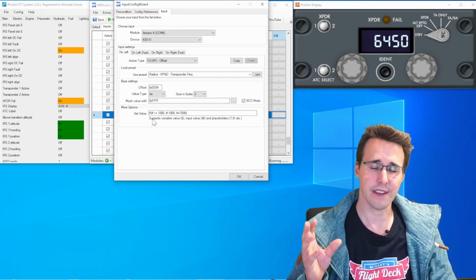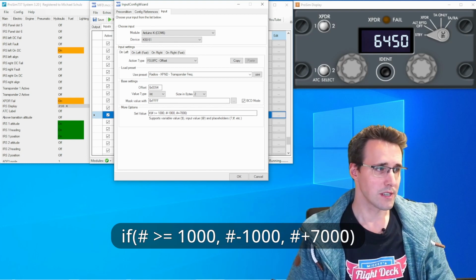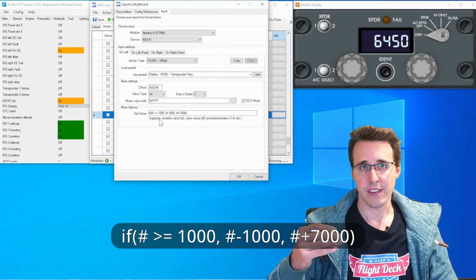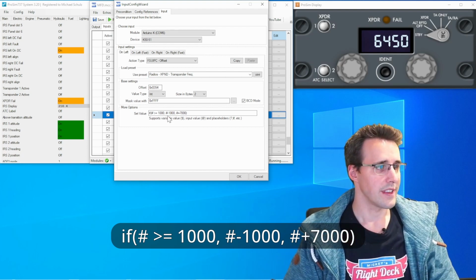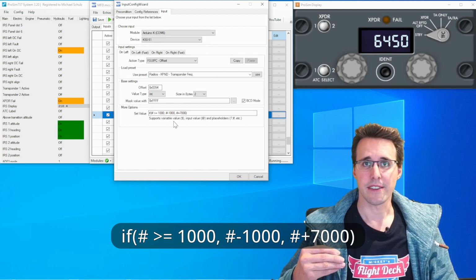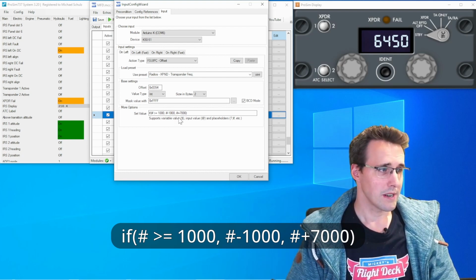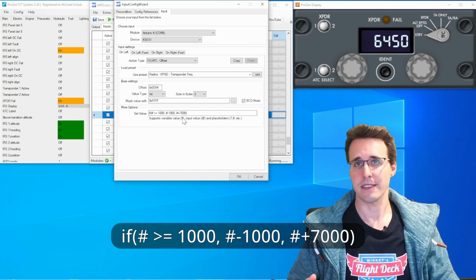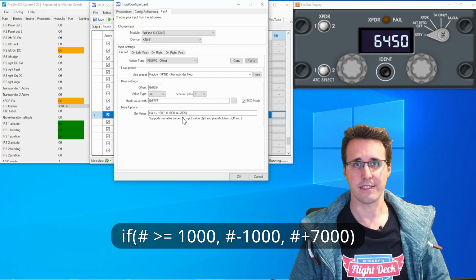So now how do we affect only the first number? If my value is bigger or equal than 1000, so I know that a 0 is not the first digit, then I can reduce the number by 1000 again, and this only affects the first digit. Otherwise, I have to add 7000 to the number. Again, it's a complete 1000 step, and so it only affects the first number.